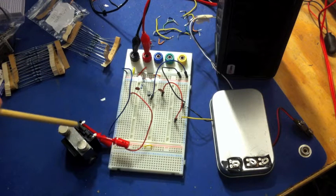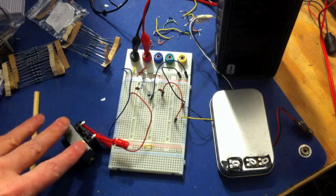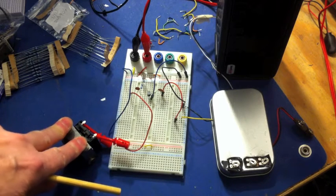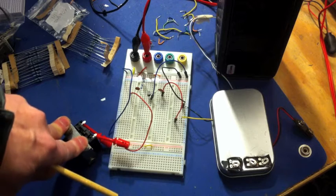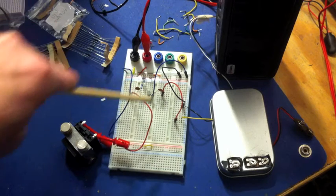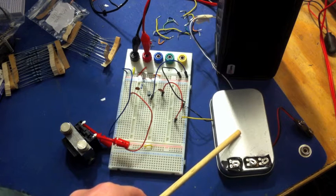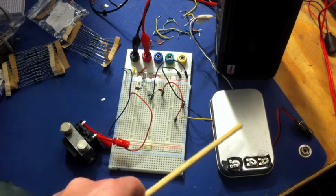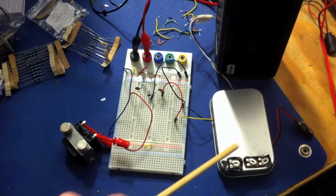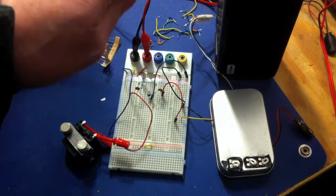What the preamp does is it just takes this very weak signal — because it's not designed as a pickup, so the signal from it is very, very weak. That means we need to amplify it up a lot more than a normal guitar pickup. So I've built this little preamp here, and then taken the output from the preamp and amplified it a little bit more. I've got one of my kits here — the computer voice — which has a little amplifier in it, so I've utilised that, turned down the echoing effects, and also used a very cheap Poundland amplifier.